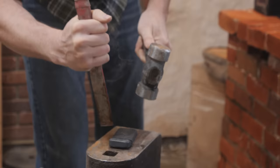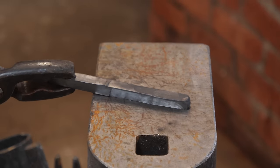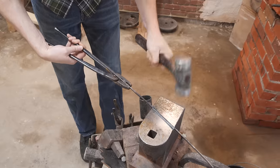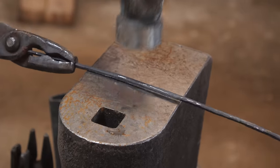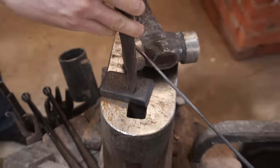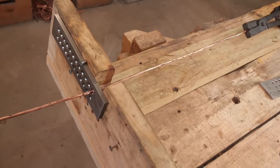For electronics we're going to want to use the more conductive metal of copper to draw some wire. Overall the process is pretty similar to drawing iron wire but potentially easier. Starting with a two-inch chunk of ingot, we hammered it down to about two feet. By slowly drawing it down through narrower and narrower draw holes, the wire was stretched longer and longer.